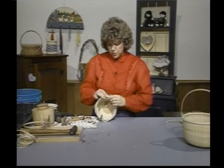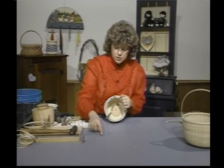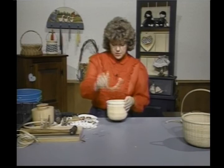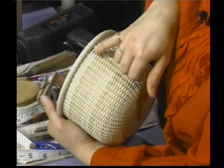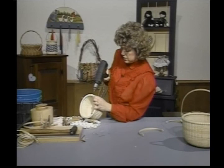Now we're going to attach this, and we attach it with these tiny brass pins. This is where you're going to need a drill with a very tiny drill bit. When you put in your pins, make sure they're even and keep them in a nice straight line. You're going to drill right through your brass ear — through the wood and through the brass ear — and that's what holds it in. Skip about every other one. These bits are very delicate, so be very careful when you drill them.